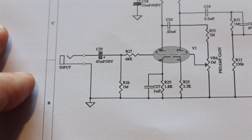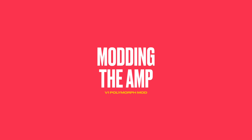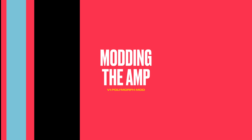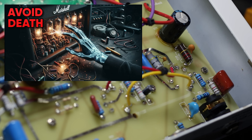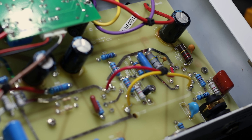What I'm going to do now is get into the amp, remove that capacitor, and replace it. Once you've pulled the schematic and know where the capacitor is, you just have to find it inside the amp — it's almost always very close to the input jack. Now, if you are opening up an amp, please check out my other video on how not to die when working on tube amps. Make sure your capacitors are drained, it's not plugged in — logical stuff, but just be so careful. Dangerous voltage is not too far away from where we're working.